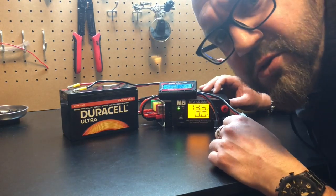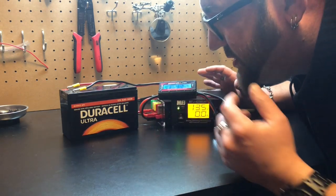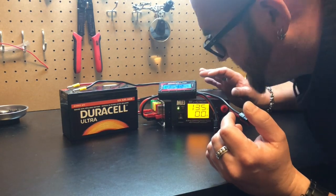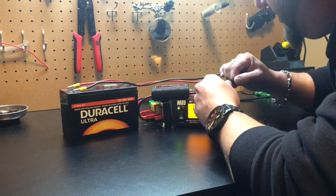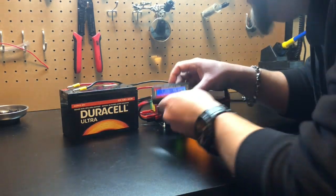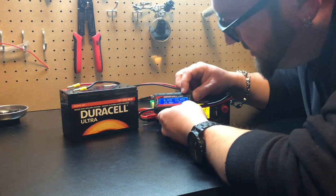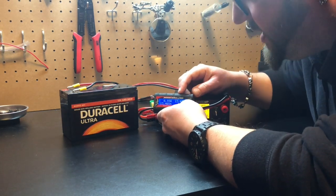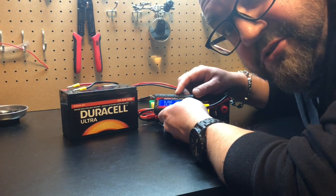So what else can we do with a power supply like this? Let's say we're in a pinch and we need to charge one of these horrible sealed lead acid batteries — we can simply plug it in and charge it. Look at that, it says 0.6 amps. This says one amp that we're pulling out of here, so we're charging. I've got this set at thirteen and a half volts, so we can put some power into our battery like this.